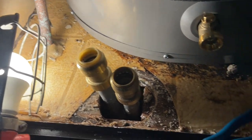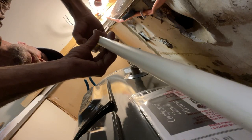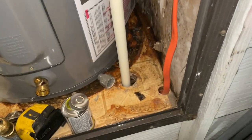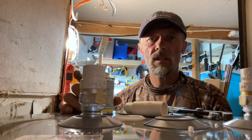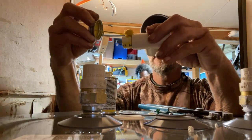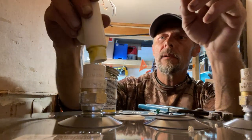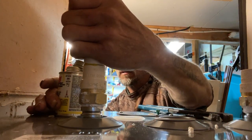That's the hot and that's the cold. We've got to tie this little line in here to the hot side, bring the cold up here, put a shutoff valve, and connect it. Pressure release goes down through the floor and the original hole it was in. I was going to use a three-quarter-inch brass threaded tee on the cold side for the expansion tank, but we have plenty of room — I'm just going to butt-end a CPVC tee right here on the cold end. We'll put an adapter on there so it has no room to play, and we sneak past that electrical and all that stuff and point it to the front of the water heater.